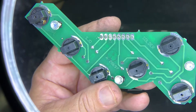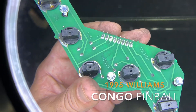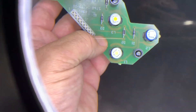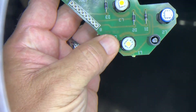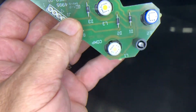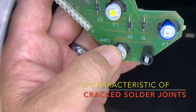Here we are under the magnifying lamp looking at Congo's lamp board that does the mystery shot. I've determined it's lamp L1, which is this white colored LED, and I believe it runs a path through diode number two right here. I'm having an inconsistent light — if you touch the board lightly it comes on, if you walk away it goes out.